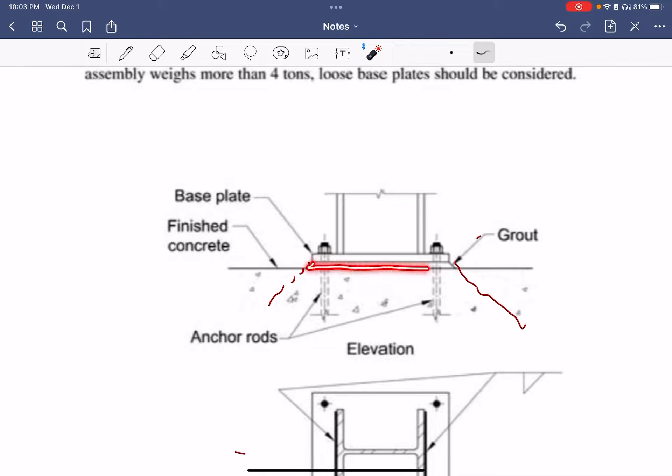There will be grout in there, and the question is: why does there have to be grout? The reason is they have something called leveling nuts. For actual structural columns — real building columns — they have these nuts below that they would adjust to either move up or down so that everything is nice and level. That gives you the ability to adjust, and once it's set, ideally you want to go ahead and grout and close it up.